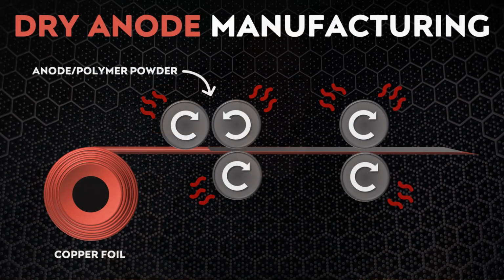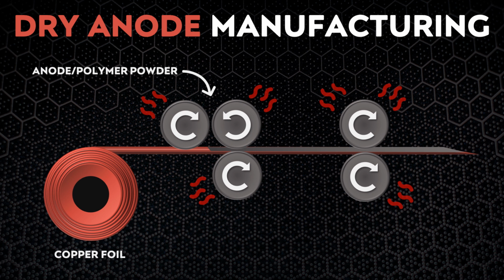Well, according to one of my sources, one of the specific issues that Tesla has had to work through in the feeding process has to do with these electrode polymer powders clumping together. Remember that during the powder to film process, the powder is being fed through heated rollers to produce the electrode film that we discussed earlier. Apparently, if a clump develops in the electrode powder as it's being fed into the machine that forms it into the electrode film, these clumps can start collecting on the hot rollers that are used to laminate this powder. Eventually, these clumps can collect together and block the flow of electrode powder from entering the feeding slot of the calendaring tool. And sometimes these clumps can be nudged through without stopping the manufacturing process.